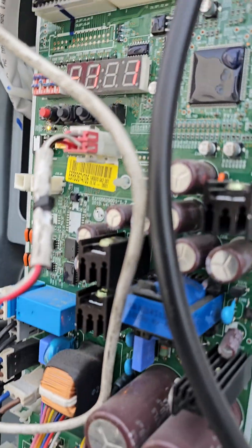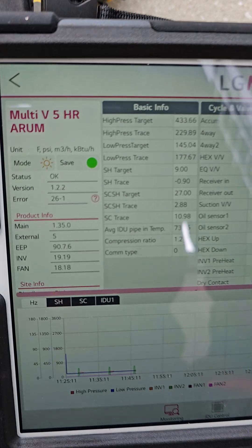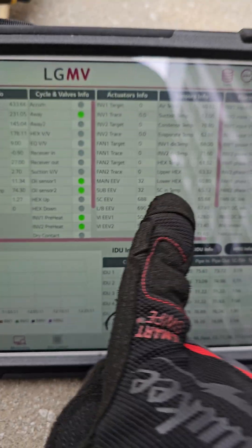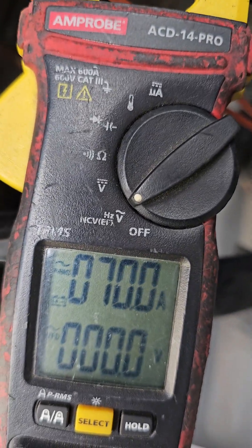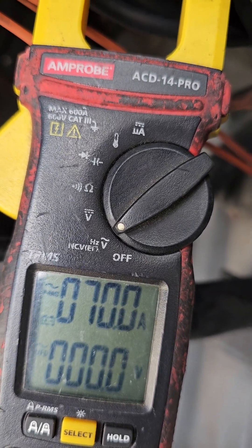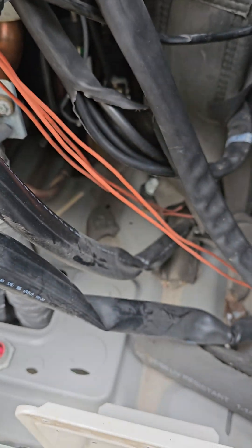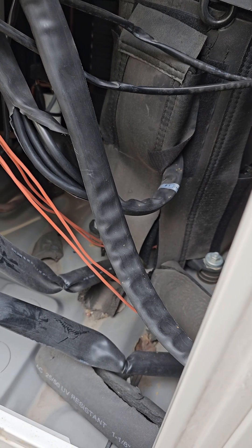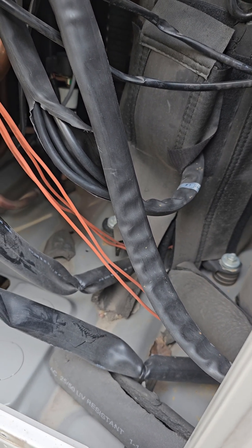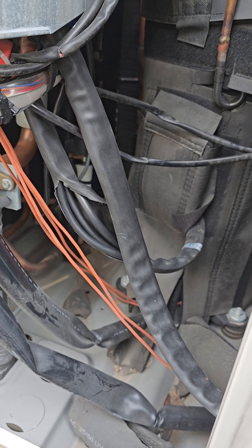I think we're already locked out. There should be a seat right here. And here it is. So I got 68, 66.2, and 70. So all three lines were drawing that amperage — we know the inverter board is putting out. They are within two amps range — they're not far apart. So the inverter is firing equally — or close enough, it's tolerable. Diagnostics: it's the compressor.